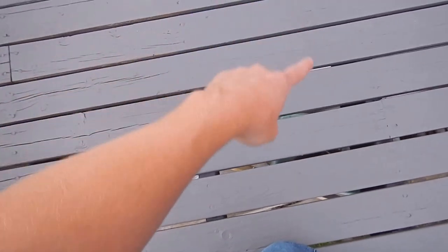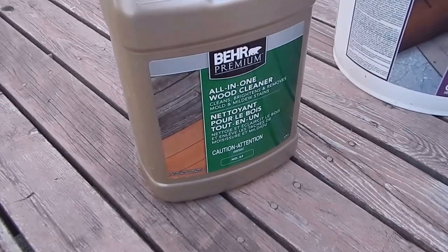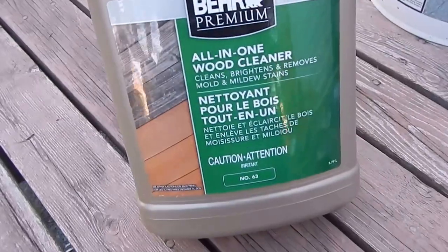This one has two coats rolled out, and this one has two coats rolled out as well as a brushed-on layer. So you absolutely want to brush it out, put it really thick, let it fill all the gaps, come back, do a spot fill, and then for your last coat, roll it out just to give you that nice, clean, and smooth finish.